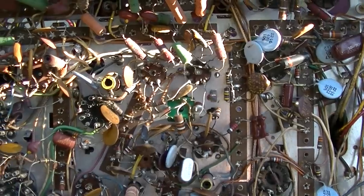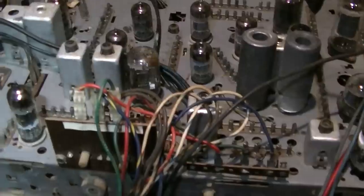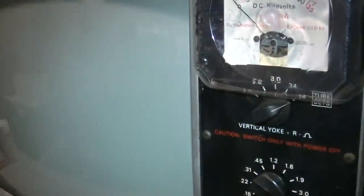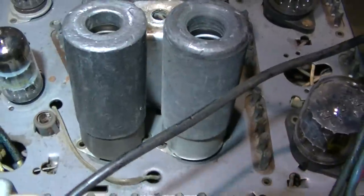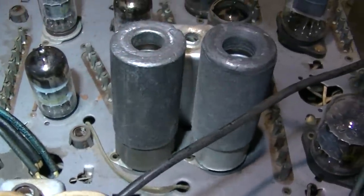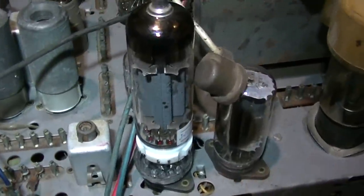This is like a Z36 or 1C36 with twice as many parts. It's power-up time for the Zenith chassis 24MC32. We're going to plug it into the jig - the jig with the bad red heater-to-cathode short, but that doesn't matter. Check out these tube shields - the top portion of those is lead. They're heavy lead-jacketed tube shields. I'm just missing one tube shield.